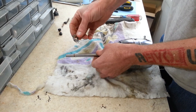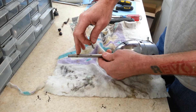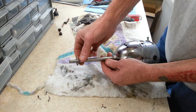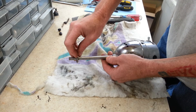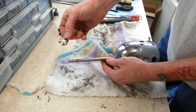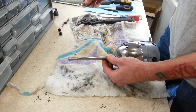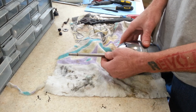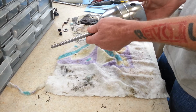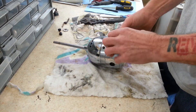There we go - it's just pressure fit on there. If you can get something on there to tap it down without damaging it, you can see the line where it sat. This has a taper to it down at the bottom so it just goes up to fit. When putting this back on, we'll heat it up and tap it up as high as it goes, and as it cools it'll be a real nice tight fit. You can get that off without doing any damage to your shaft at all.